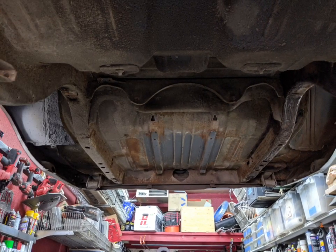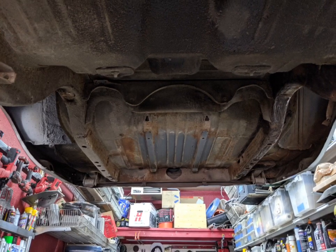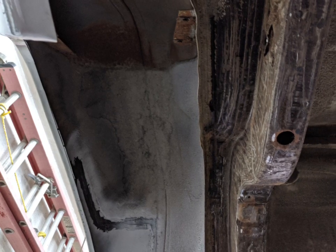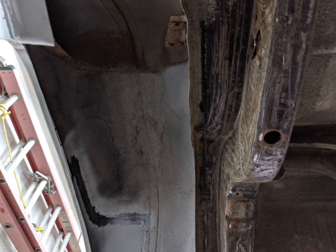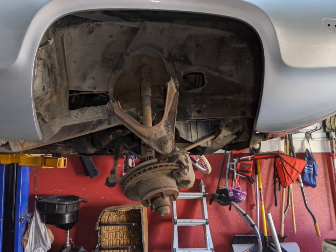Here's a look at the rear of the car. It has a lot of surface rust, but luckily the undercoating protected most of the underbody. Looking up into the wheel well, there's 14 inches of tire clearance. I could get a few more inches if I mini-tub it, but I'm not sure I'll benefit from that the way the Model S unit mounts.